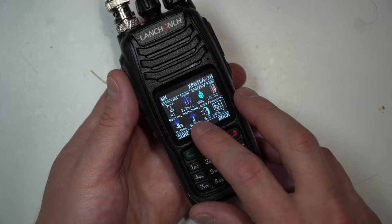The major glaring downside to this radio, for those of you that love APRS, is that it doesn't do APRS messaging. The FT3DR is pretty close to a full-featured APRS radio right out of the box. Better APRS implementations are the Kenwood D74 and D72 — I just find the interface clunky. No messaging means that really this is just a beaconing radio. It receives beacons and displays weather station beacons beautifully. The display on this is actually really, really nice for APRS, and it's also fine as just a Chinese radio for simplex or repeaters.